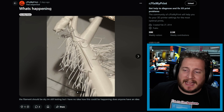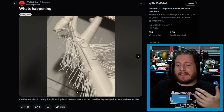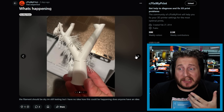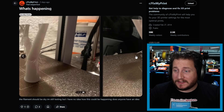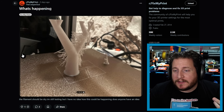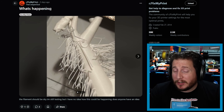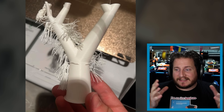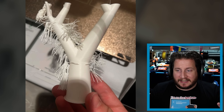Starting off wondering what is happening to filament — it should be dry — and they have no idea how this could be happening. We can see long strands of filament coming off the supports. Unfortunately, we don't have photos of the actual part itself, which would be useful. But if we take a closer look, it's not retracting at all. You would suspect moisture in the filament would create some level of stringing, but this is not stringing.